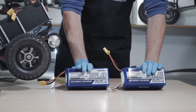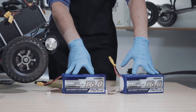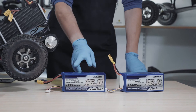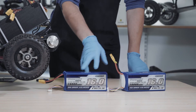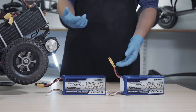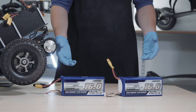So here we've got our two batteries — two 6S batteries. Now if you've had these from brand new, when you receive them they're on a low voltage and need bringing up to storage voltage. That'll bring each cell up to 3.8 volts and balance them out nicely, then they're ready to be fitted in the box. While they're in the box, you can charge them up to the full 50.4 volts as a whole 12S pack.